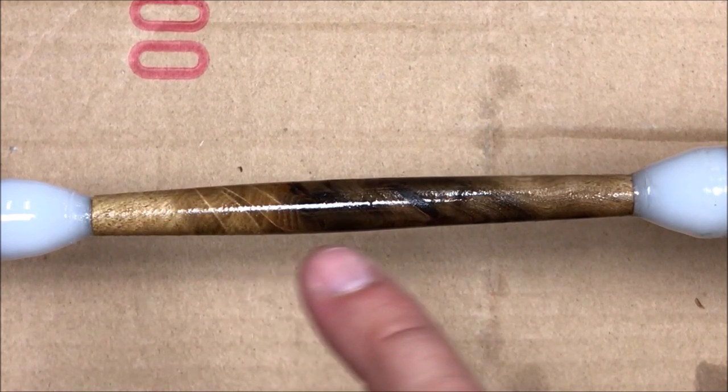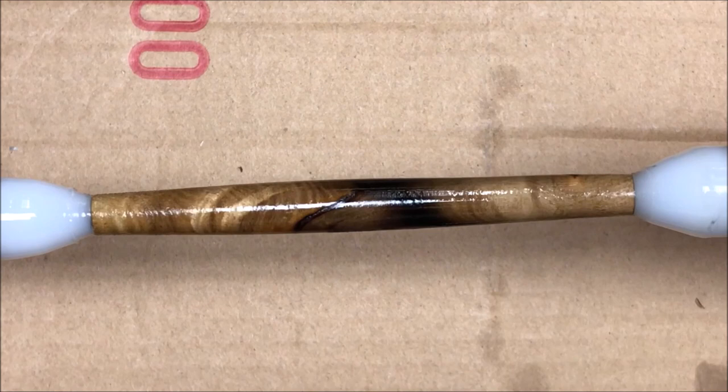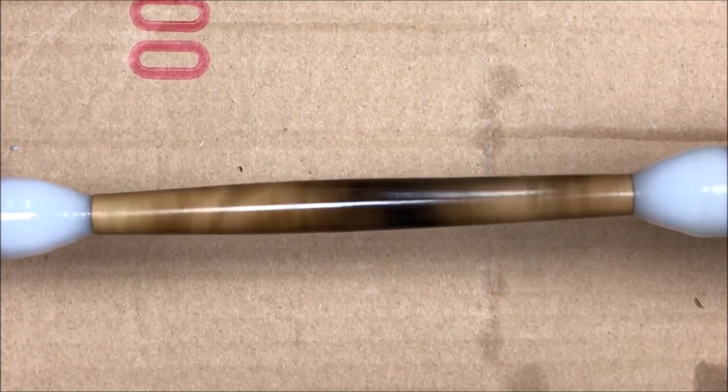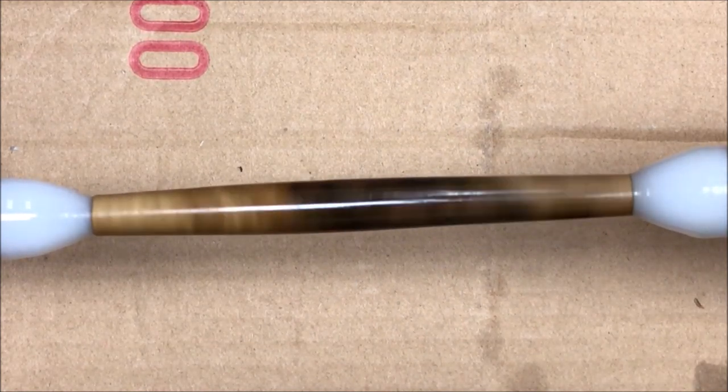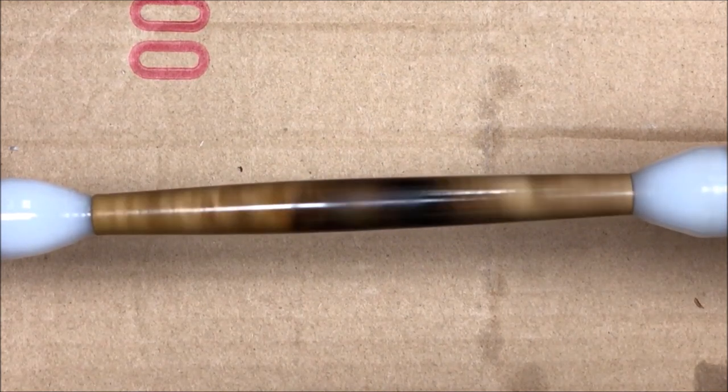It's extremely humid and hot out here in the shop, so it's going to take a little longer than normal to dry, but I'm just going to let the lathe spin, and we'll get about 5 coats of thin on there, and then we'll start applying our medium to really level the blank and build the finish. I'll come back when I've got the finish on the blank. We'll take a peek at it, and then we'll get it buffed up.